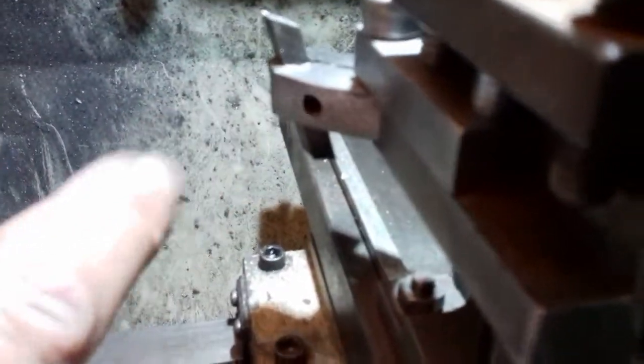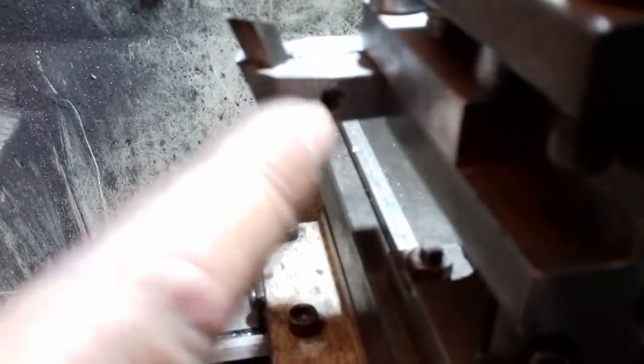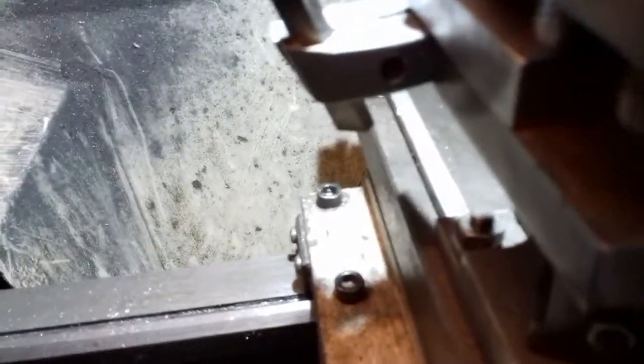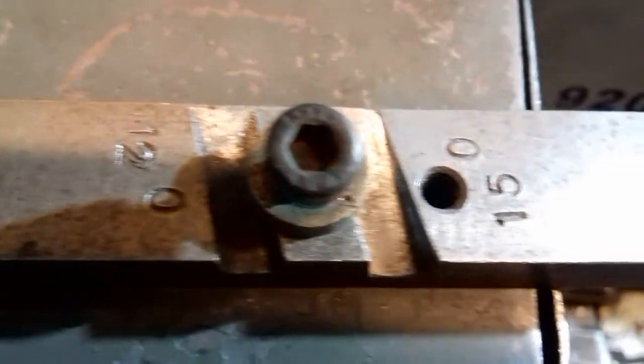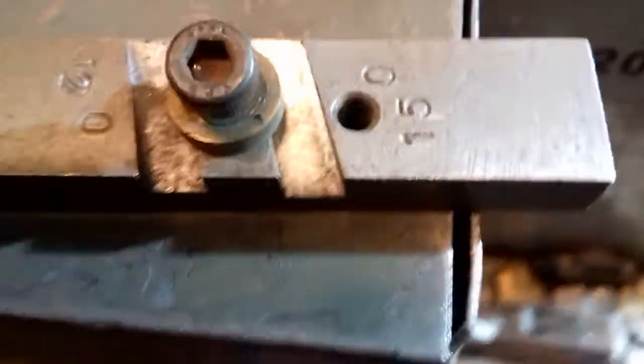Right, so go down the side so you can see what it is. It's about a 16-degree angle in there, and what I did is make it so I can sharpen it pretty good. I've made this up, and that's at 15 degrees up and across, and I've made another one that side which is 12 degrees. There, that's focused now. That's my sharpening bit.